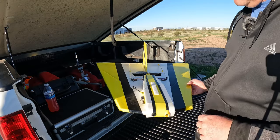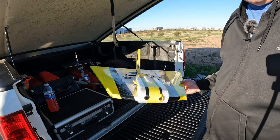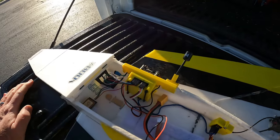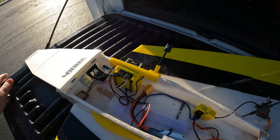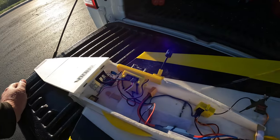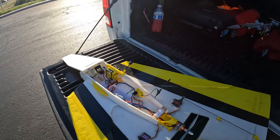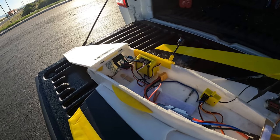It was designed for a 2200 size battery and to be able to carry the weight of a camera and the camera gear. I'm using the Q-Lite OSD just to give me the on-screen display data so I can have my battery voltage, my altitude, and the home arrow, as well as my ground speed and my distance from home. I do not use a flight controller on this. For the type of flying I'm doing, I want to be able to have instant response, so I am not using the flight controller or any pass-through.